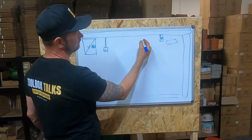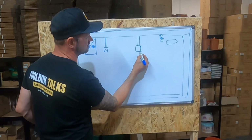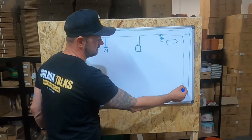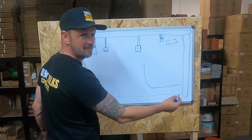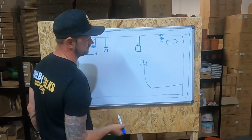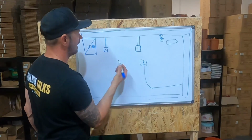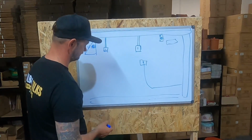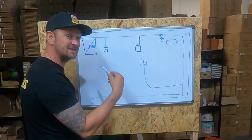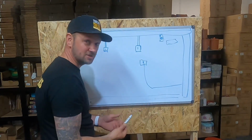And then we'll come along and we'll come out again in 20mm plastic conduit into an intermediate switch. And then we'll come out of here, out the Galv trunking, with a 90, which I'll show you bending as well, in steel conduit, into another 2-way switch. So all these switches will be controlling that floodlight, and it'll all be wired in singles. This is a little bit different from the other videos where I've wired it in twin and earth cable. This is more an industrial example of how you would wire 2-way or intermediate switching.